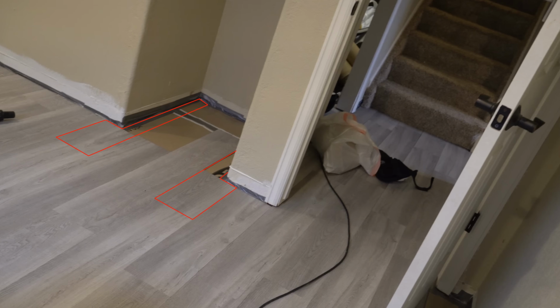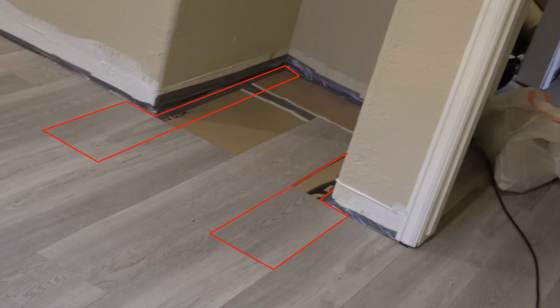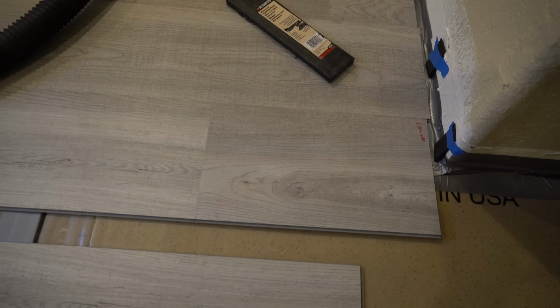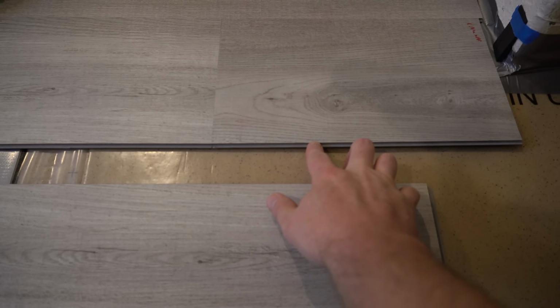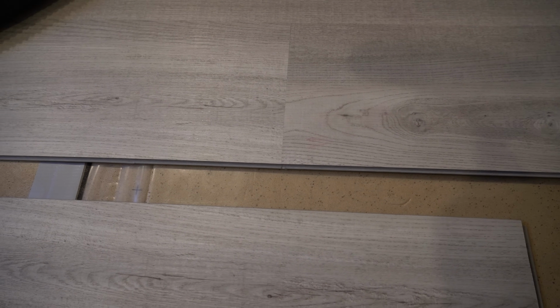So instead of cutting it straight down, what he should have done was made these L-shaped notches and cut it with a jigsaw. That's why he skipped it, because he knew it was going to be tough, but now that we can't finish it out, you actually have to tear up all the floor and go all the way back to that spot to finish, which you can see I did here. So it actually created a ton more time by trying to go too quick. So when you're going around corners, make sure you don't make this mistake, and I would just recommend finishing everything so everything behind you is just done and you know it's correct and you can move on.